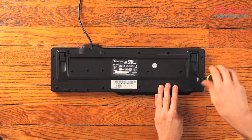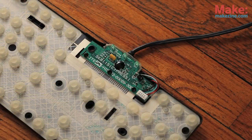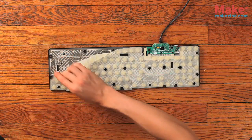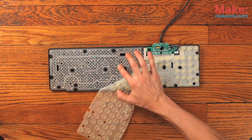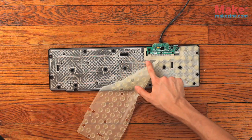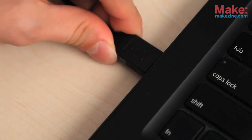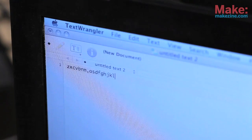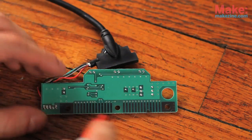After you remove all the screws and open up your keyboard, you'll see the USB interface which connects to this contact pad. The keyboard distinguishes between different key presses by closing different pairs of contacts on the board. To find the right pair, you can either trace the leads from a key you want to press, or you can plug it into your computer with a text editor open and just do a little trial and error. Once you've found the contacts you want to connect, mark them off.